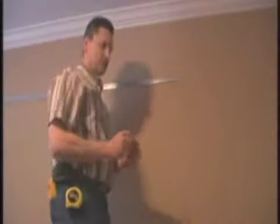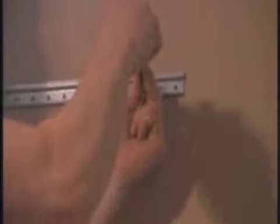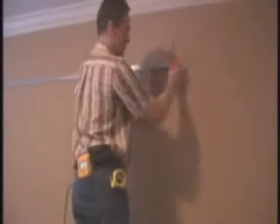Knowing that I have a large cabinet here that's going to sit on the floor, I'm not too concerned about this because this upper cabinet will actually be screwed right into that 8-foot gable that's going to be there and give it lots of support. What I'm going to do is use these easy anchors, and I'm going to apply those right to the end of this rail, and I'm just going to mark where they go, and like I say, I'm going to put them just 1 hole apart, and it gives it a little bit more strength.